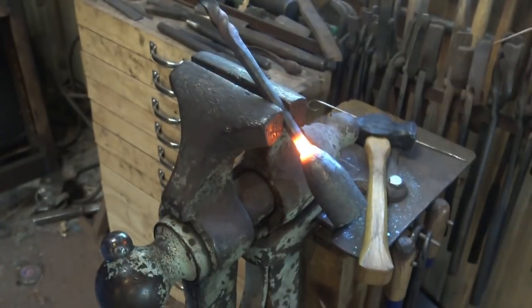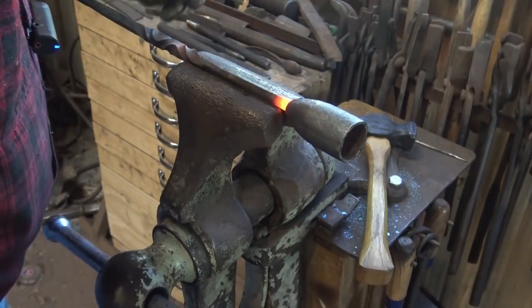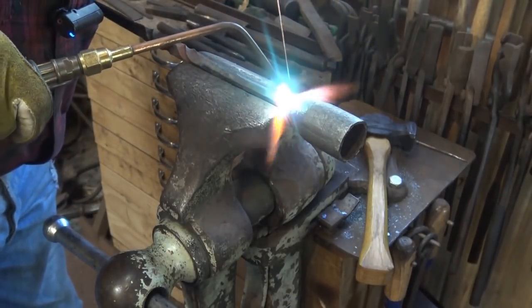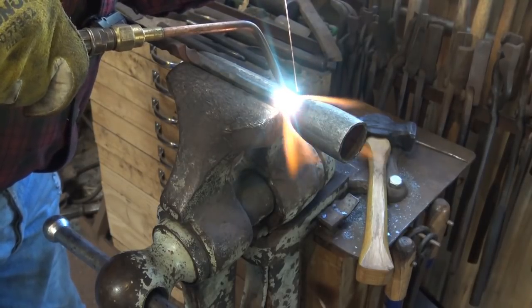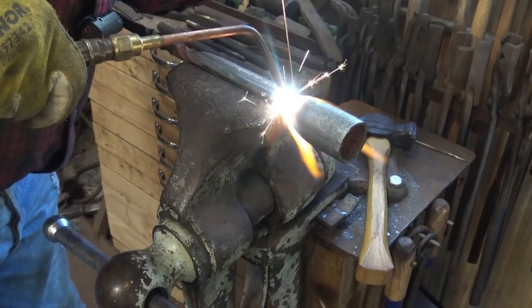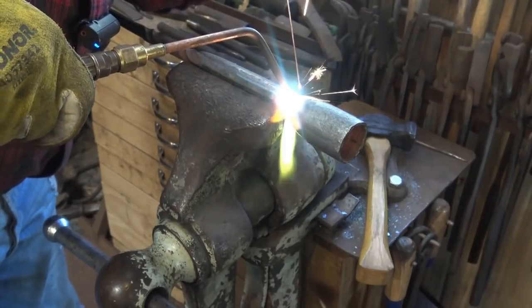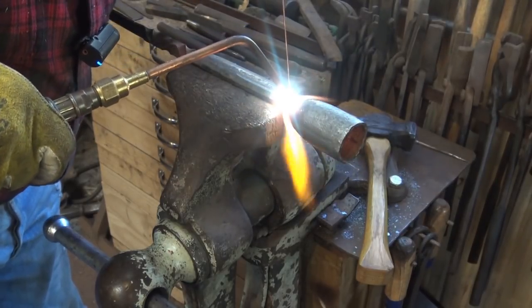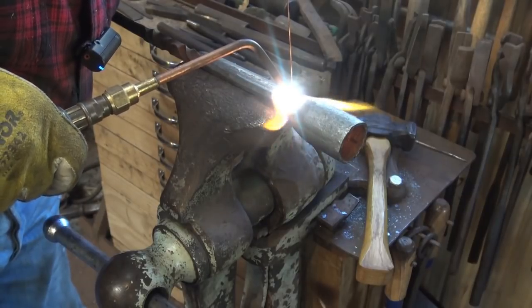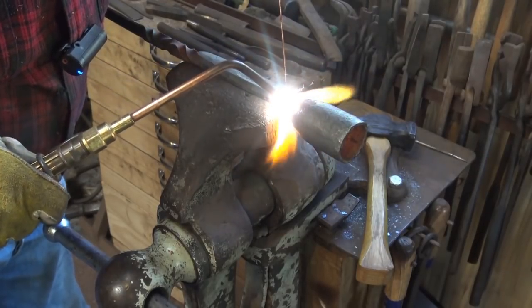One problem with this is it's round and you've got to keep moving it. But now that I've got that started, I think I can work it up here. For those who aren't familiar with this type of welding, what I'm trying to do is just melt the very edges of the two materials and let the material flow together, and then add filler rod as necessary to fill any low spots. It's not just a matter of melting filler rod onto the surface and hoping it sticks to something.